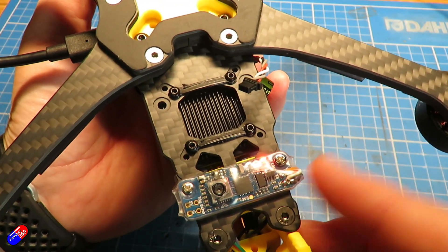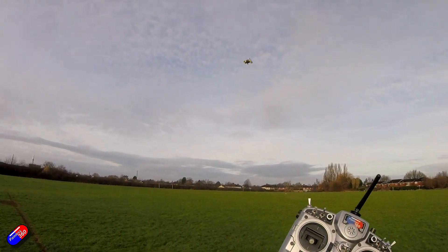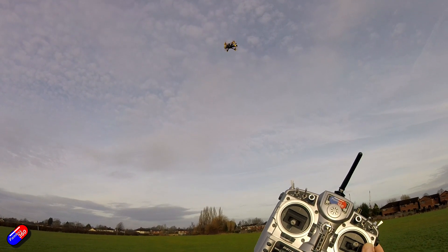Why would you want to add an extra little board? As you probably saw in that first video, if you have the compass calibrated and GPS working, it'll do position hold, return to home, fly missions and all kinds of stuff. You get two advantages by adding this board. First, optical flow is like what's on the underside of your computer mouse - it takes a little video of the ground and compares movement moment to moment to figure out which way the quadcopter is moving and uses that data to stabilize. Second, the rangefinder is very handy as it's coming into land - it'll know exactly how high it is off the ground rather than relying on guesstimation from the barometer and GPS.